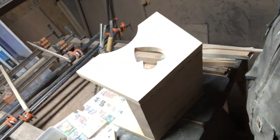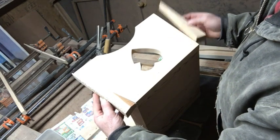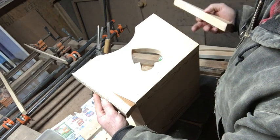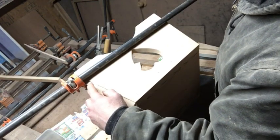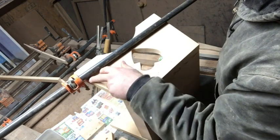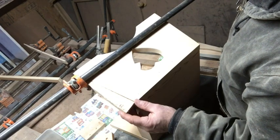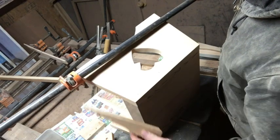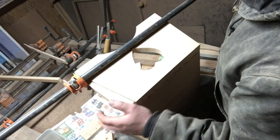Here's a tip that might come in handy. When I glued the legs together I saved these little wedge-shaped pieces to put in between the bar clamps so the bar clamps had a 90-degree edge to work off when clamping everything together. Two things happened: one, the piece of wood kept it from marring the finished wood, because clamping can dent the edge. It also helped to keep everything lined up and square. That's the point of saving those little wedge-shaped pieces - you can use them to clamp this together while it's drying.